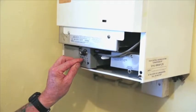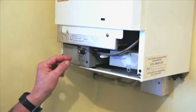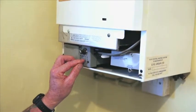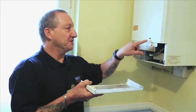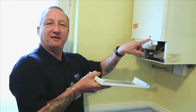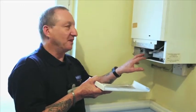Now, if you find boiler on, that's saying your external controls are working. If you go to fan on, that's telling the machine the fan is working. If it doesn't proceed any further than that, look through the little window — if you can see a spark and a little pilot light, then that's indicating a fault with the gas valve and you need to call us.